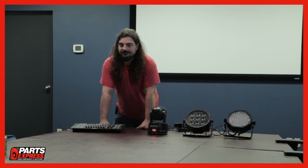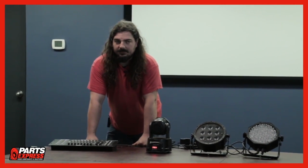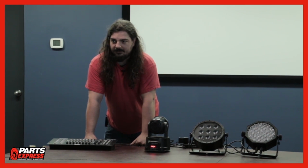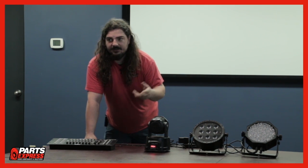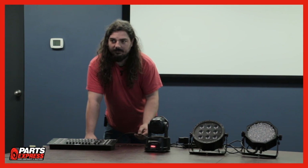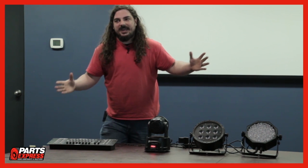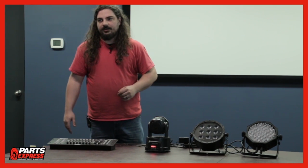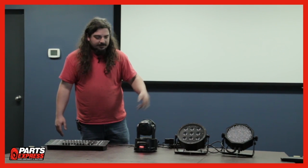Yeah. I came late. What is the difference between the DMX cables and the XLR? So, the DMX cable is wrapped different. It's data cable rather than low impedance audio signal cable. Basically the same thing like a Cat 5 or a Cat 6, how the pairs are twisted together to give it a special sort of impedance. These are normally 110 ohm, 120 ohm along the run. It gives it a wider bandwidth because it is just a digital signal going across it. In short runs like this, I could absolutely get away with microphone cable, line cable, yep, no problems.